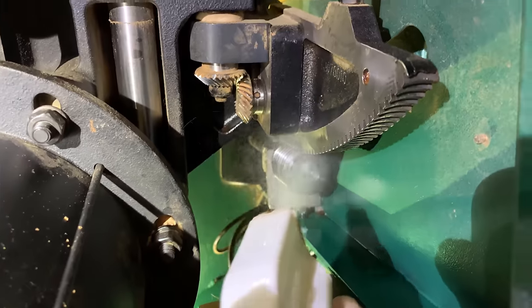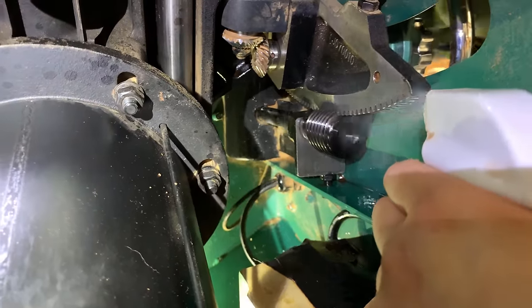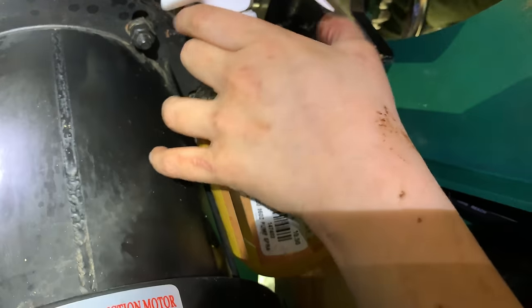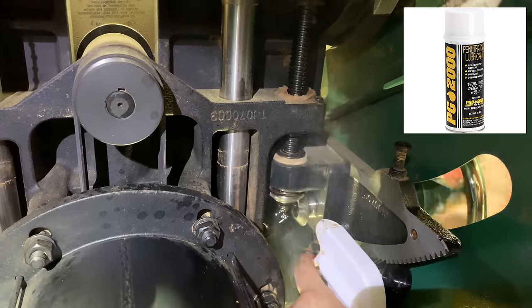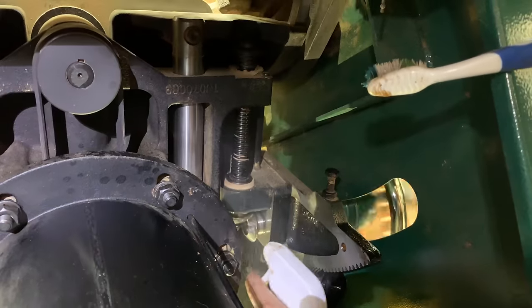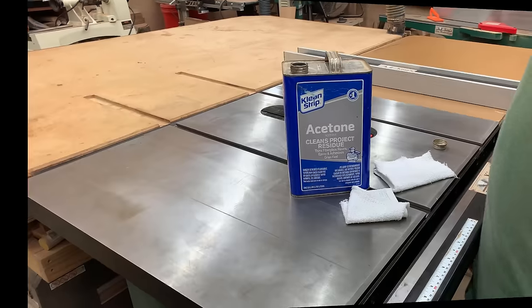Now the gears are a lot more exposed and easy to see. The next step — a very critical one — is to lubricate the gears. This helps raise and lower the blade and tilt it to various bevels; without this the table saw wouldn't operate as smoothly. What I'm using is a product called PG-2000 made by Pro Gold. The old packaging was a squirt bottle; the new one is an aerosol spray can. It's one of the best solutions out there. Using grease would attract dust and you'd have a problem right away, whereas this actually repels dust.